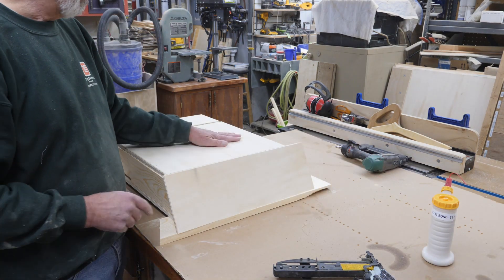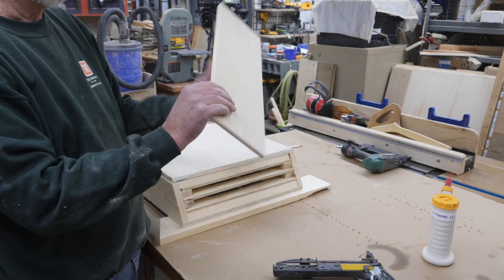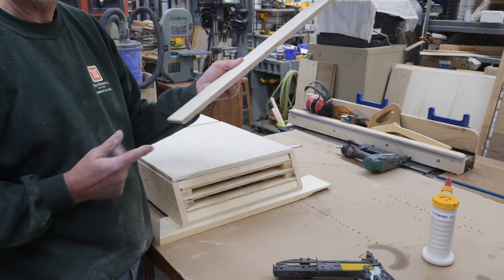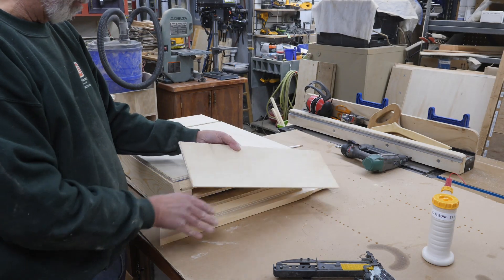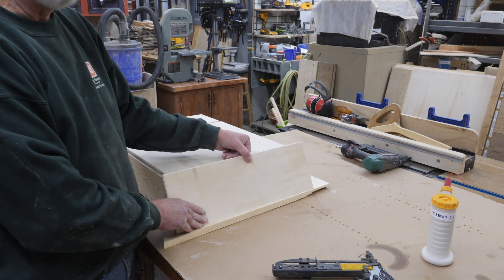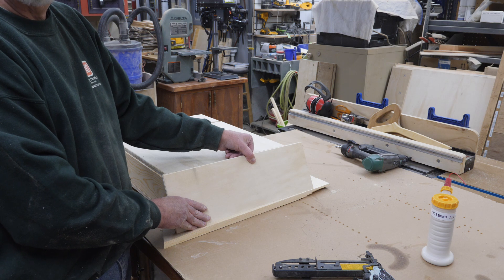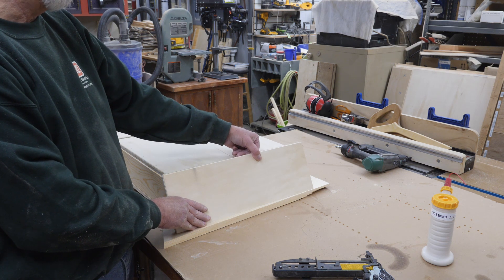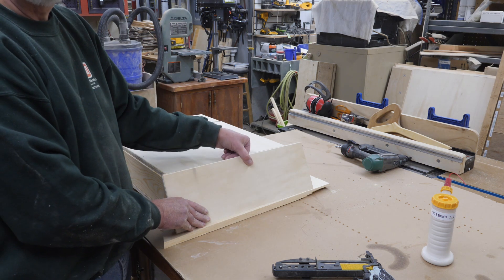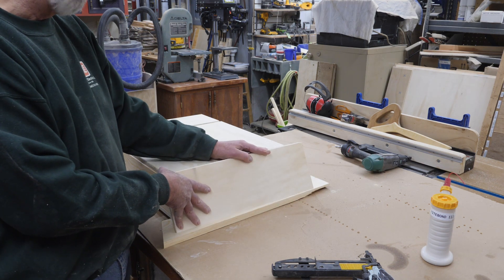The next step will be the roof panel. I took it over to the router table and rounded the edges on the front and sides, top and bottom, for a more finished look and to keep from getting splinters. I've got a spacer board under here to make sure it's absolutely flat when I staple it on. The roof could be covered with a shingle, granulated tar paper roofing, EPDM rubber roofing, or even truck bed liner — I've seen that done on birdhouses and don't see why you couldn't do it on a bat house. All I need to do is make some marks to even my two sides out, put some glue on, and staple that on.